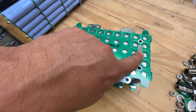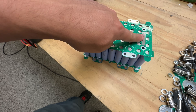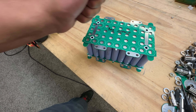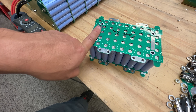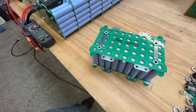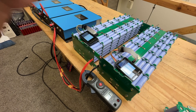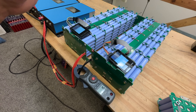That's what these modules are — they have this exposed piece right here, and I've put one little strip of nickel in here. The part I want to transmit power through is this flat plane that's sticking out further, which means that's the part that will be touching and have pressure on it. I don't know if there's going to be enough pressure, so we're going to do a test. What you see here is seven modules this way and seven modules this way — this is a 14S module now.